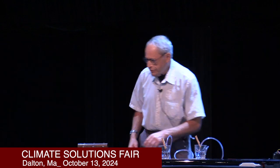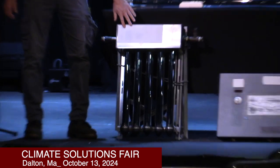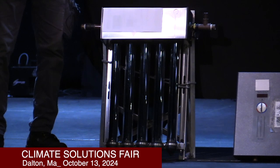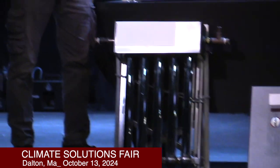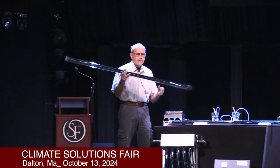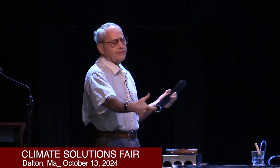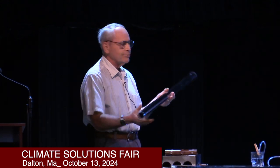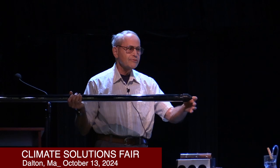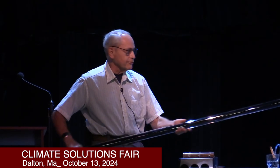The other style — more modern, but still around for more than 20 years — is the evacuated tube style, right here. This is a miniature with five tubes installed. The real ones on my house have 30 tubes instead of five, and each tube is a little more than five feet long. This is an empty glass tube — my finger is on the inner glass, my thumb is on the outer glass. It's fused over on the top, and on the bottom there's a nipple where the air was removed between the two glass tubes. So it's a vacuum — like how a thermos bottle works.